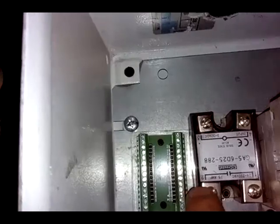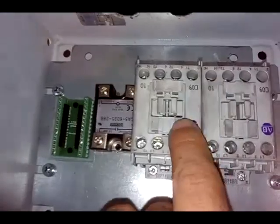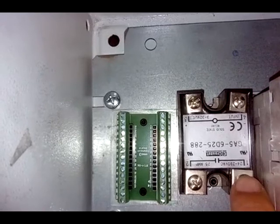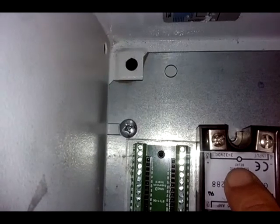This here is a solid state relay that will turn on the coils. The coils will be in parallel and will be driven with the output of the solid state relay, which is probably a triac with an optocoupler diac inside.